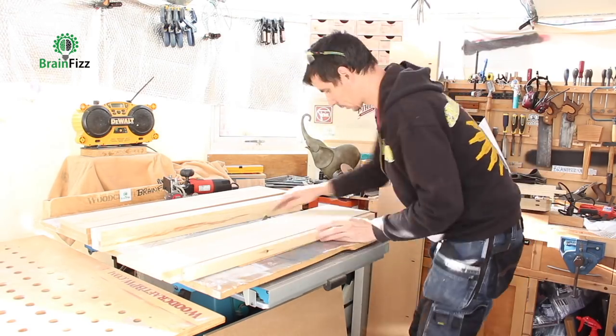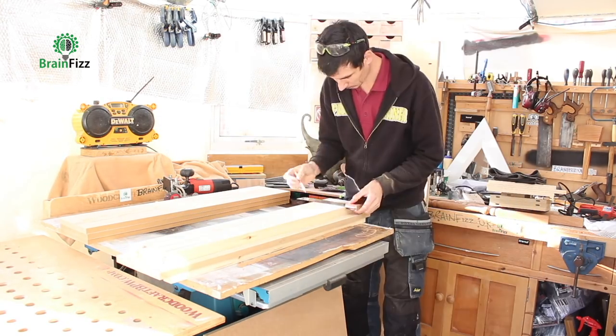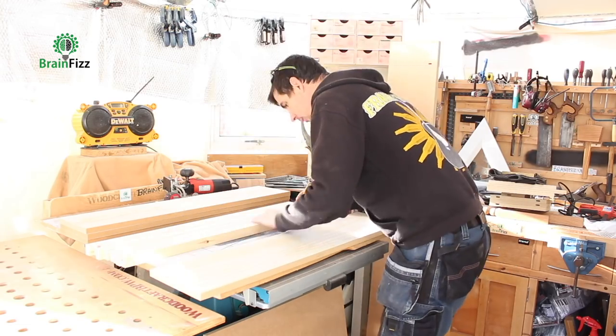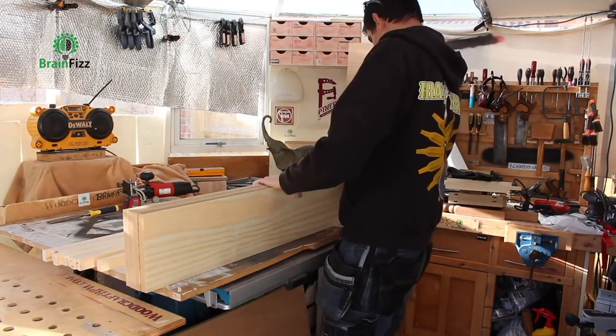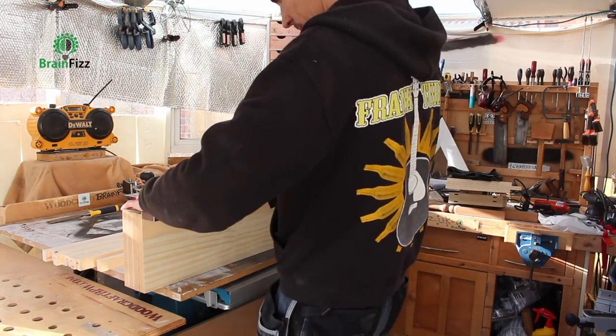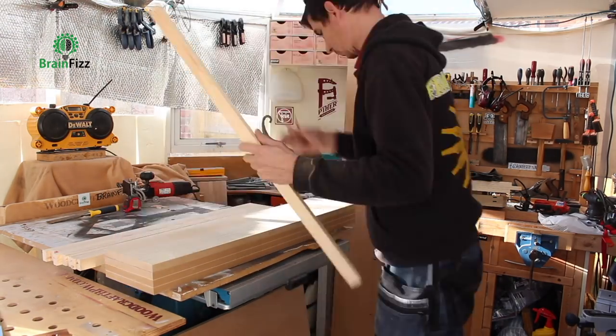Because I'm wanting them flush on the top and still parallel, I'm using biscuits to align the tops of the shelves with the tops of the lipping. What I like to do is gang them all up together, marking one, and then transfer the measurements across to all the shelves for that particular bookcase. That means that although I can't use one lipping for any shelf, they're very close.